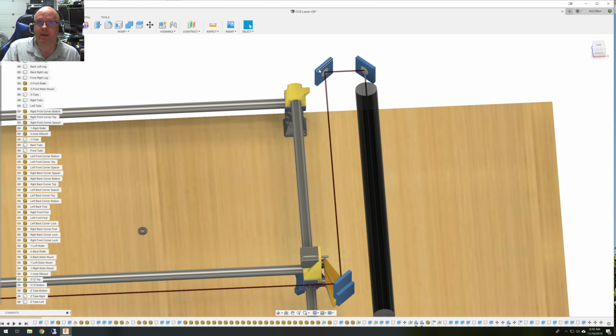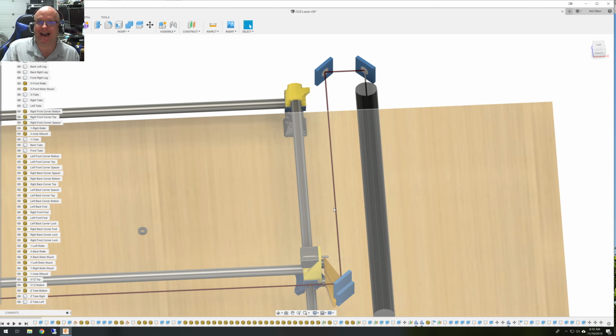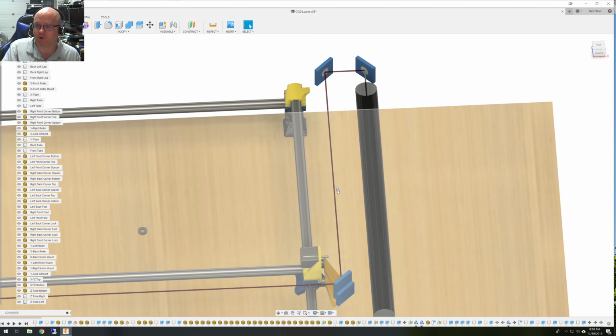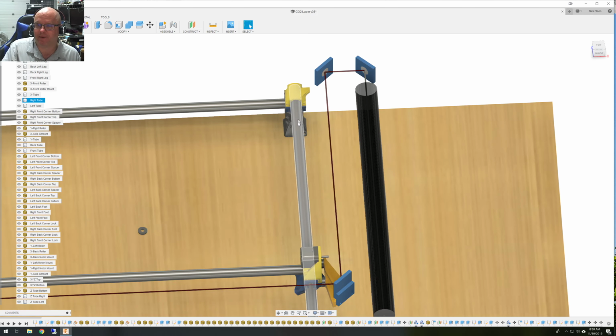That's all you need, because then that static mirror's job is to be in perfect alignment with mirror two. By perfect alignment, I mean the mirror surface and the mirror surface should be at the same height, the same X, Y, left and right, so that this line that it winds up creating is perfectly perpendicular in all regards to this travel tube. And the way you can do that is what I did.